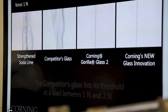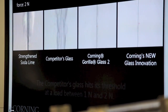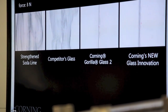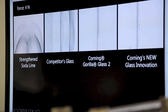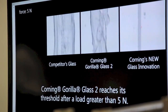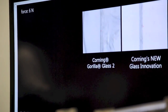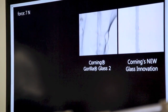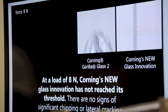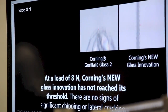As you can see, the soda lime glass is already scratched at one newton. The competitor glass is already starting to scratch at two newtons. Gorilla Glass 2 is still not showing any lateral cracking up to four newtons, and all the way up to greater than five newtons before you see a lateral crack. Gorilla Glass 3 is still not showing any lateral cracking all the way up to eight newtons — that's way better than any of the competitive glasses on the market.